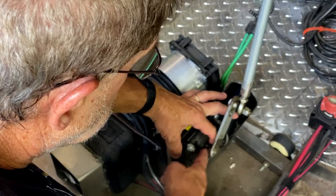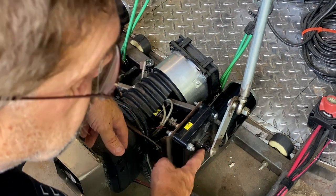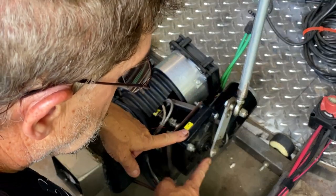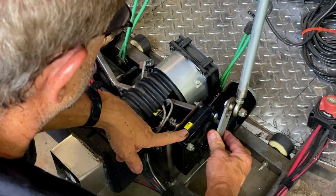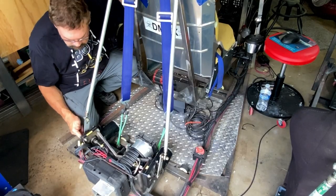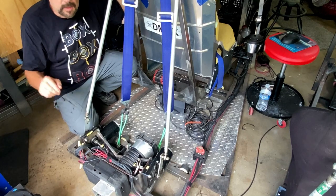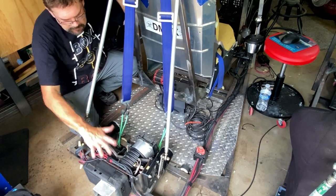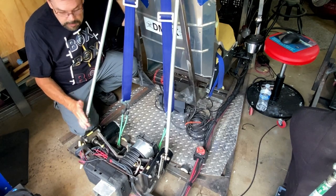For the lever arms, there's a little hole that was supposed to have a cotter pin, but that kept snapping off because of the amount of torque these motors deliver. What I ended up doing is welding all the way around it on the inside — these are five-inch lever arms. When welding things onto these motors, I don't know if they'll melt, so I just do one little tack, cool it down, another tack, cool it down.